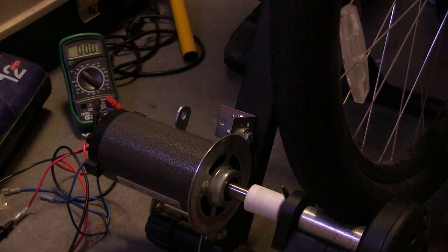So that may actually be a problem. Without trying very hard, we can get 30 volts out of that. The circuit that I had intended to build for this, that's going to be way too much. It's going to mess up the circuit. So we may have to put some safety features in, that anything over 20, it's going to have to just flip a relay to keep us from blowing out our circuit. So yeah, it's going to be interesting.